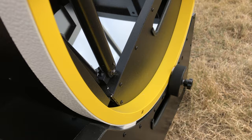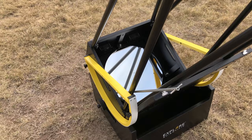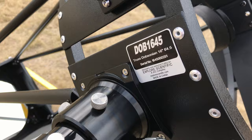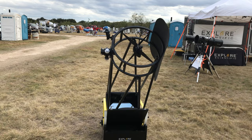You can see the interior of the mirror box. The bearings are very interesting — they use hockey pucks as the tension knobs, with Formica and Teflon bearings, which are pretty standard for this style scope and work really well. The action is pretty smooth. It's an open design so it's pretty light when you're moving it around, but it does have some grab, so you can put it in place on the sky and it'll sit there.